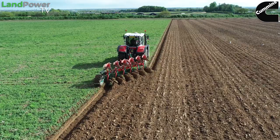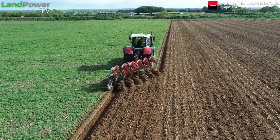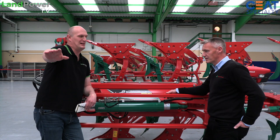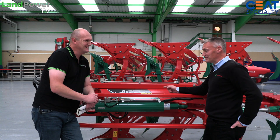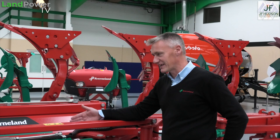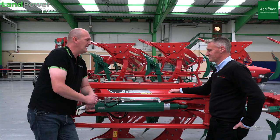The other reason is guidance - plowing with guidance. Obviously you're then putting the tractor up on land so it can steer in both directions, right and left, to make sure everything carries on straight. All the plowmen are booing and hissing at this point! But also, you can go in-furrow - that's not a problem at all. It's a simple case of pulling the hydraulic cylinder back in, and the plow is then in the in-furrow position. So you've got the best of both worlds.